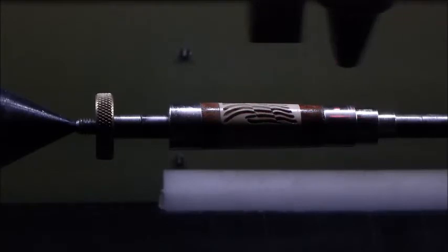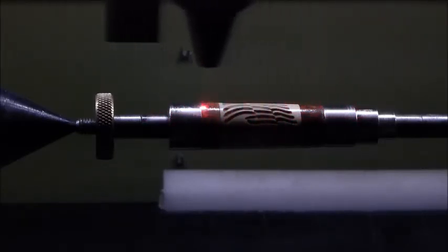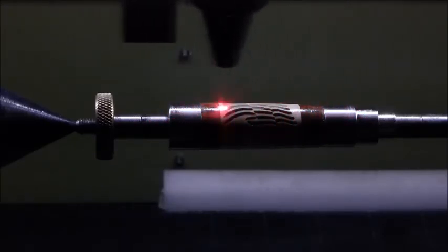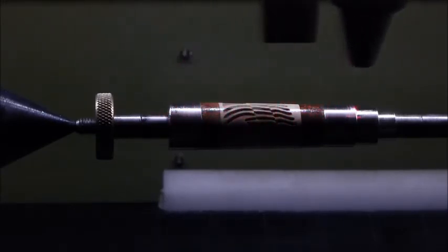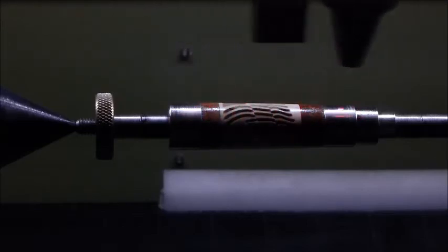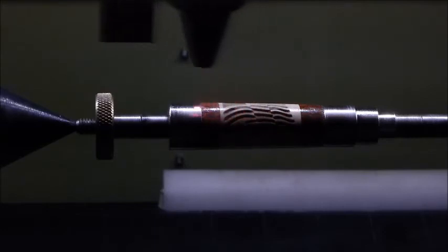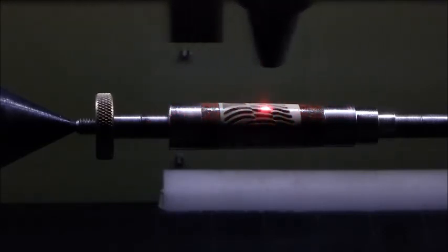With wood, it's not necessarily that important, because the fibers in the wood burn regardless. You end up with some inaccuracies just due to the fact it's wood. Grain, sap, glue, space between the grains. I've stuck in the same settings, two different types of wood, and one's turned out beautiful and the other one's turned out like crap. So using a laser on wood is just kind of a gamble. I'm getting the hang of it, but anyway, a lot of you seem fascinated with this thing, so I'll try to get a top shot for you.